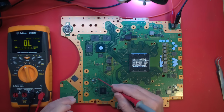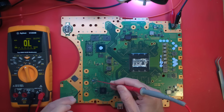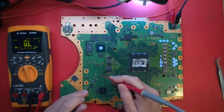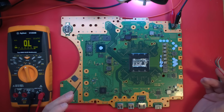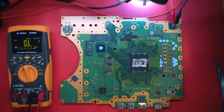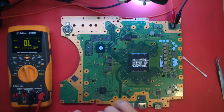There's of course 5 volts goes in through F7003, right in here, and there's a rather large capacitor on this side, and a rather large one on this side. Both of these are 5 volts in. Like these two points are connected. So most likely we could have a shorted. I don't know if this is. Let me clean it off. This is a DA9065 or if it's an RT5126. I don't know. Does it matter? It does not. There's no obvious scorch marks on that thing.